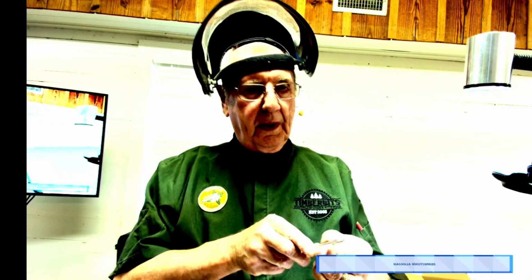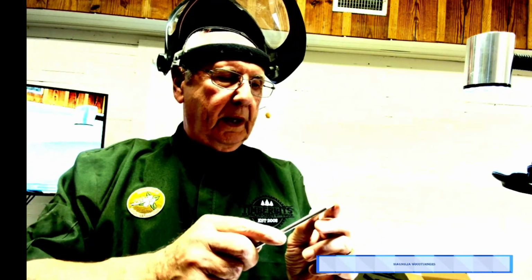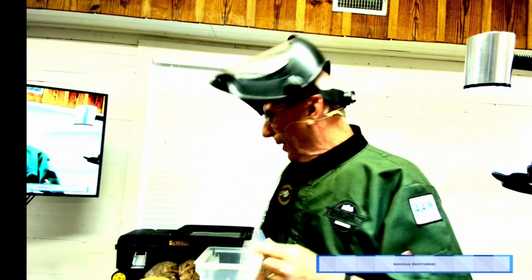Anyway, if this is your wheel, well, it's kind of hard to show. You basically hold it here with your fingers on the tool rest, and you just barely touch it to the wheel and bring it around at that angle. Just go around once. There is actually a burr on there, and that's what's cutting. But you don't normally need to do that.